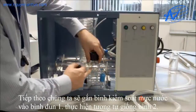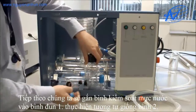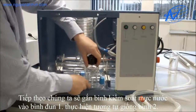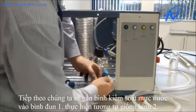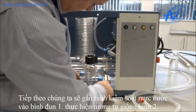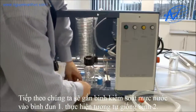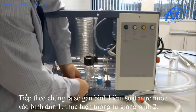We then connect our boiler level control to our boiler. First of all we put the split nut onto the boiler itself and the central piece of the connector. The sleeving must fit inside the boiler itself and inside the boiler controller. Our boiler coupling is then done up.